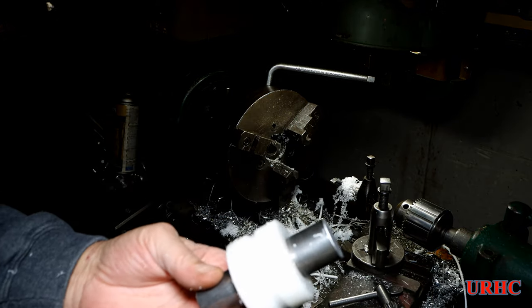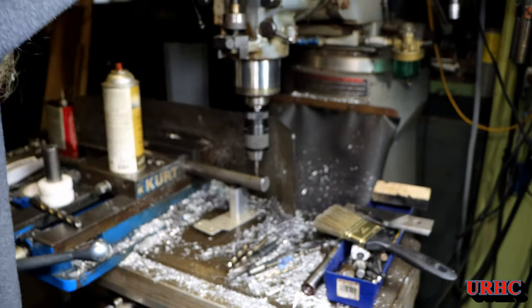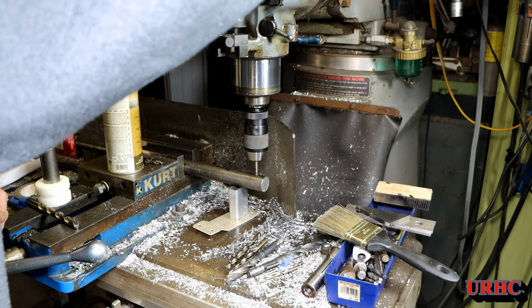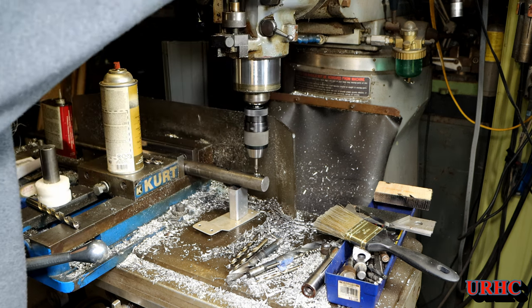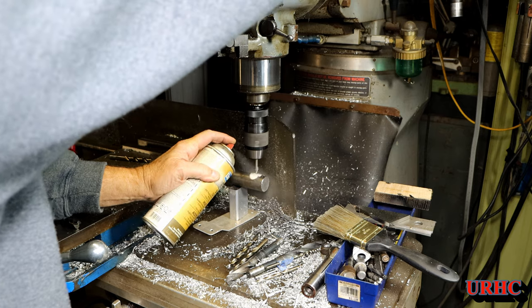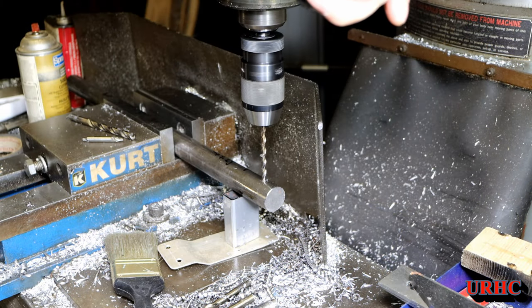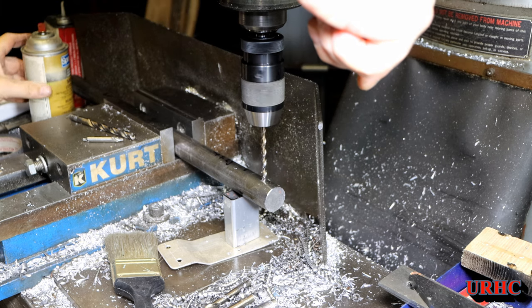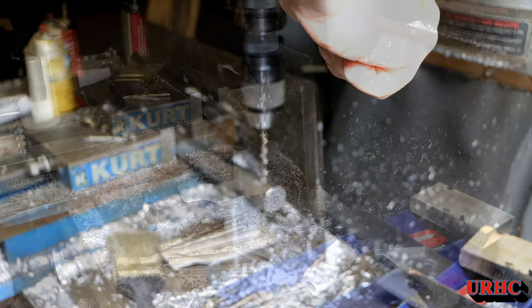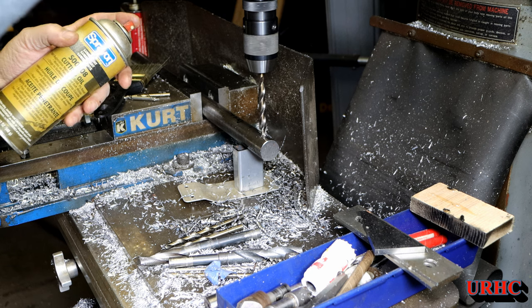That's a piece of UHMW polyethylene — real slippery polyethylene that'll stand up good as a pulley. I went over to my old Bridgeport and had to drill some holes to mate up with the existing bumper on the Sidekick. First thing you do when drilling holes in any kind of good steel, especially round stock, is take a center drill and get a little center point started right on the top edge of the round. Then you can go to a regular drill. I just use spray cans of a good cutting fluid, then go to the final size — 5/16-inch drill for the 5/16-inch bolts.